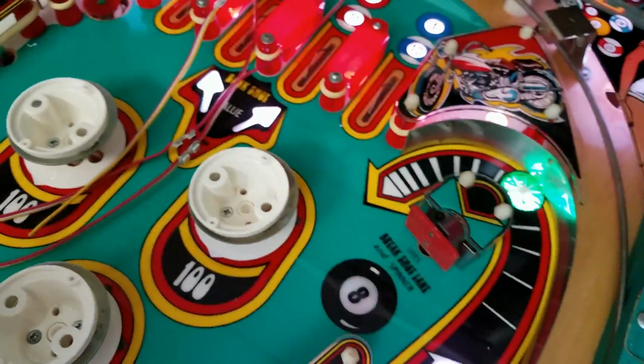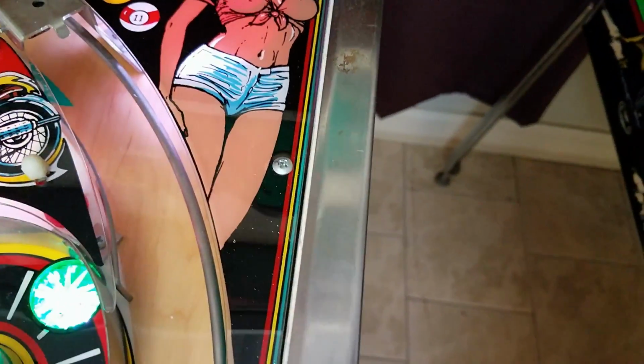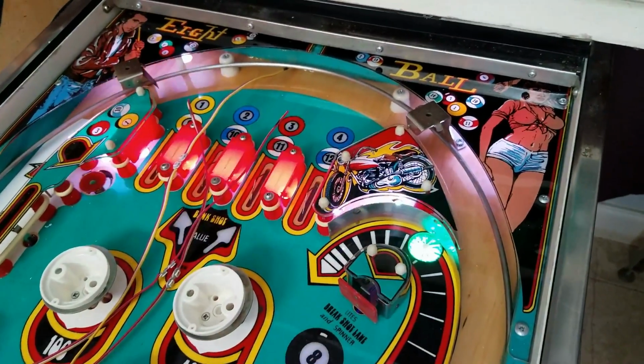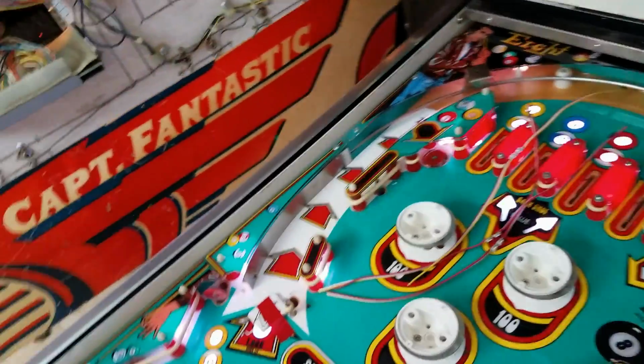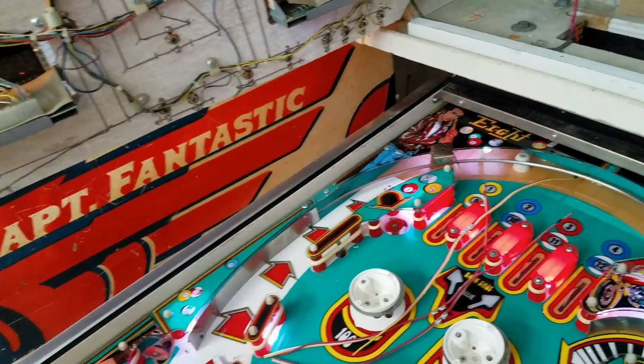You know, the GI lights appear not to be going off. They're just dimming. Well, the GI lights shouldn't go off at all. Right, they don't blink by this code. Okay, but the fact that they are dimming is an indication that the string can't get enough power.